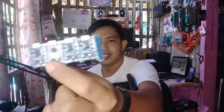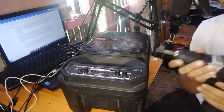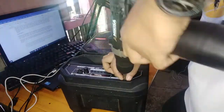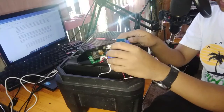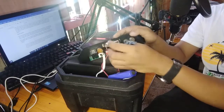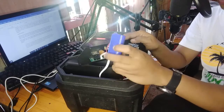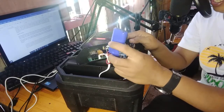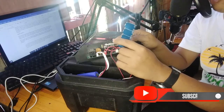We're going to use this TP4056 module, which is used to charge lithium-ion batteries. Please continue watching as we repair this Bluetooth speaker. As I open the Bluetooth speaker I can see the circuitry — this is commonly seen in different kinds of Bluetooth speakers. I confirmed that the battery is an 18650 lithium battery, and what I'm going to do is directly charge it through the TP4056 module.